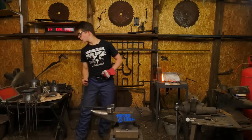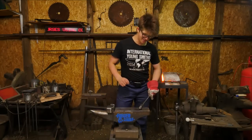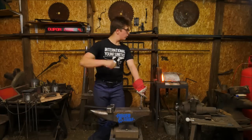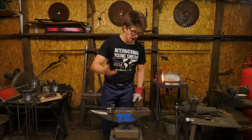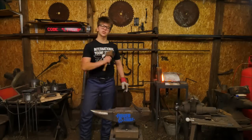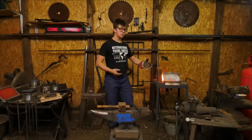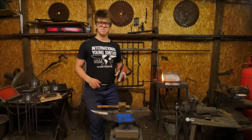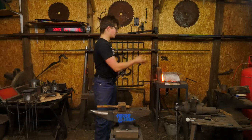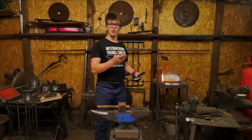Okay, Jason Rinaldo. What a wonderful name. I apologize if I shouldn't have said it with the accent. He has asked me how long a tank of propane lasts me. There are variables to it, such as how I'm running the forge. Right now, I'm running it at a somewhat low pressure, which means that we are using less gas. Again, I want to reiterate, the pressure that you're running on it does not directly correlate to the amount of gas you're using.